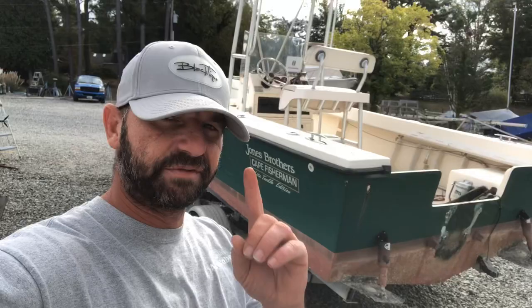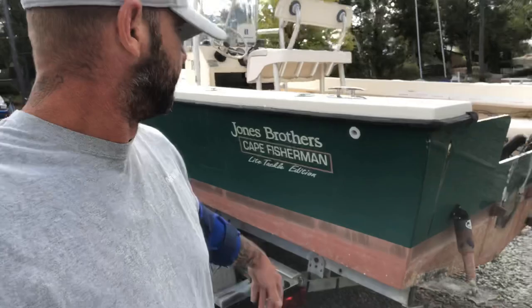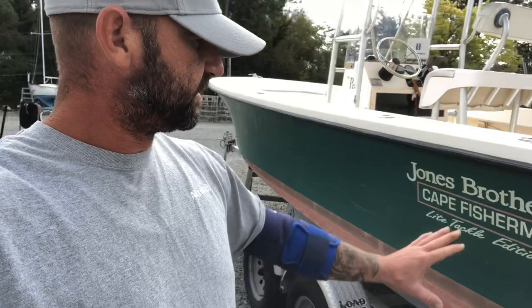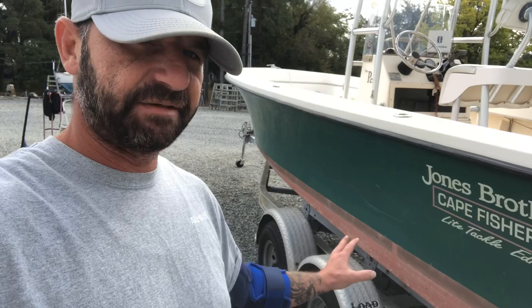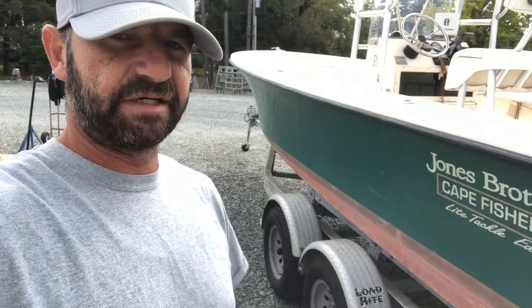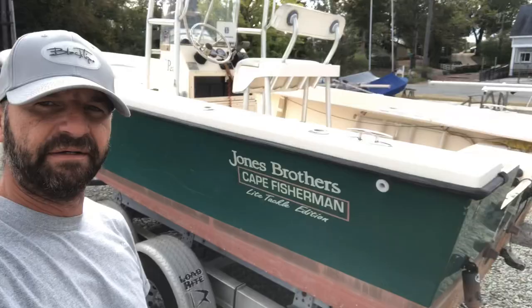So with that being said, my first step, I'm gonna remove all the stickers. I'm just gonna use a regular flat razor blade, solvent clean the adhesive off, do my wash scrub with the Scotch-Brite and Comet, and then get to sanding. I'll start out with 120 grit, and then I'll glaze every spot I can find that's messed up. Sand those spots with 120 and get three coats 545 on it, jump to the top coat prep. So with that being said, here we go. Little project taking off now.